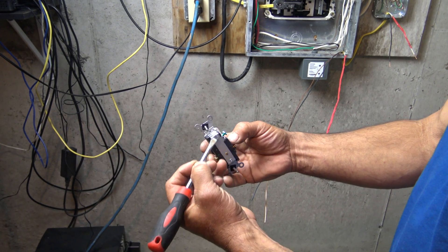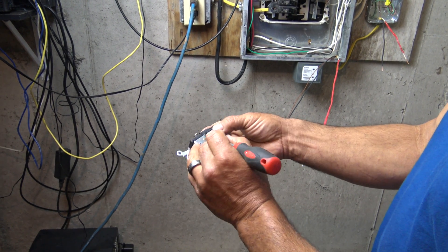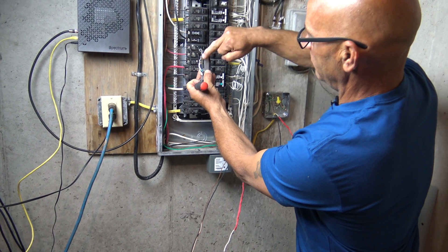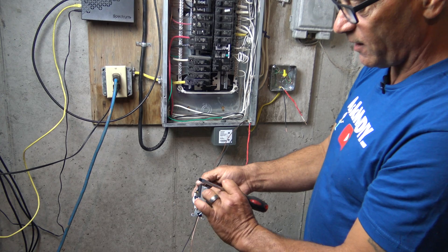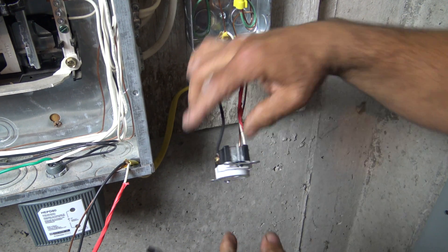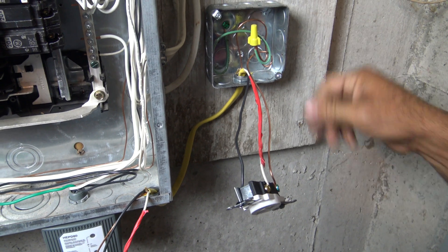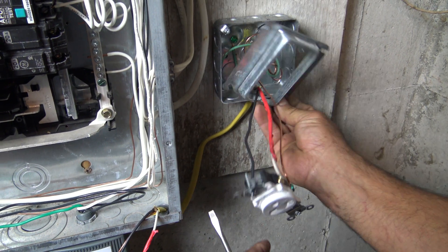Follow the ground — all the metallic connects to the screws that's ground. Each one of these screws represents each hot coming in. Electricity doesn't know colors — it's both hot. So it doesn't matter where our white wire goes versus our black wire, as long as both are connected to the hot terminals. Our wires are now connected to our outlet — black wire there, white wire there, both hots connected, and our ground. Being that this is a metallic box we had to ground it, so we put a grounding pigtail to the ground.